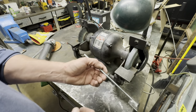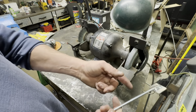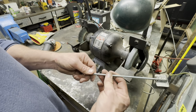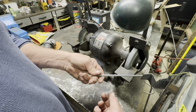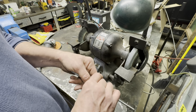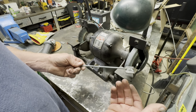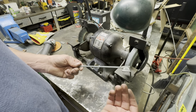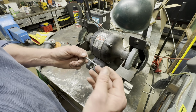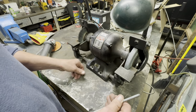And quite often on a job I use bolts that are much longer than what I need. So then I just take my slitting disc, cut the bolt down to what I need it to be, and then clean up the end. I do that because I don't want to have to carry five different lengths of bolts or screws in my box, right? Just have them all basically one length or just two common lengths, and then just make them what you need.